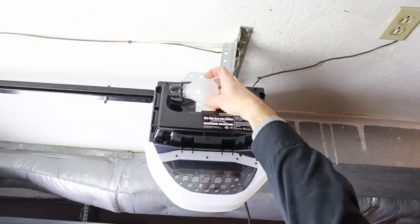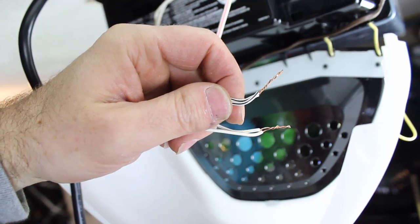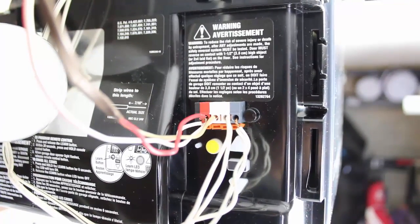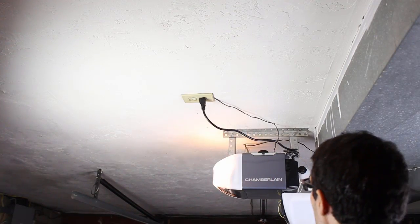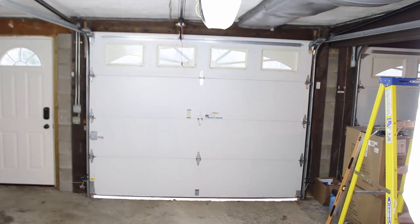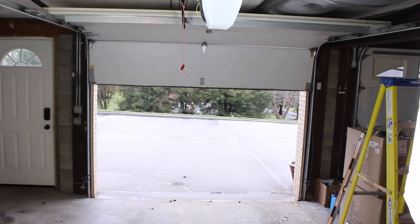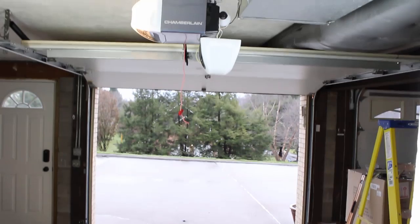Re-engage the trolley and put one or two lightbulbs into your garage door opener. Wire it — the cool thing about the Chamberlain system is that the wires just slide right into the terminals, which is really simple. Follow the directions according to your wiring setup. Plug the garage door opener in — the lightbulbs will blink three or four times. Press the garage door opener button and check how it runs along the track. In this case, it was smooth, quiet, and worked out great, which is why I really like this Chamberlain garage door opener.